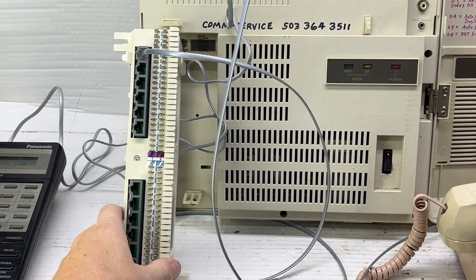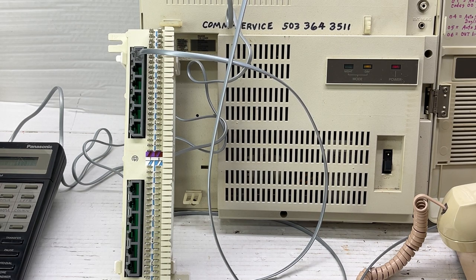There is a 66 block — which is what this is — and it has network jacks on the left side that are brought out to punch-down terminal blocks, 66 type block terminals. The jack is a four-pair jack, also known as eight wires, and of course all eight wires do come out. There are massive amounts of different configurations of modular to 66 or 110 type devices in the world that you can find on eBay. If you're connecting a system up and have phones on longer runs than cords you want to plug directly into the control unit, no problem — you buy something similar to this and then put modular cords between the jacks.